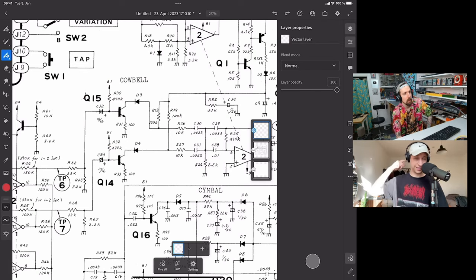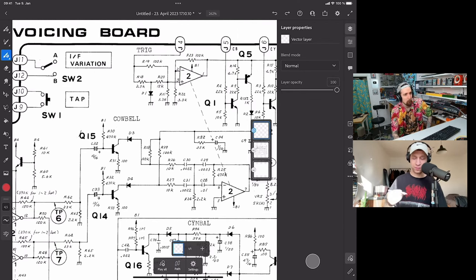I remember at first, Simon, you just got a kick out of it. You just got a thump and that was it, right? Yeah, I basically got the pulse that was supposed to trigger it. But that's likely to be on me though. So we tried a bunch of different stuff. We tried replacing the transistor with something else, removing diodes and whatever, and nothing really worked.